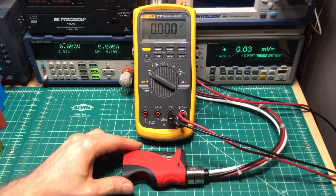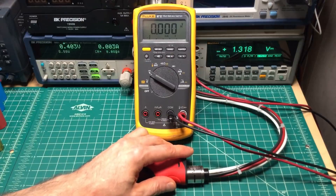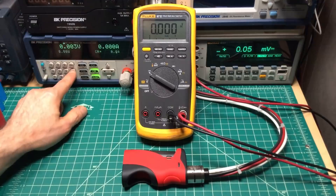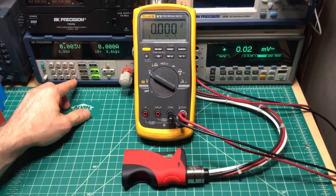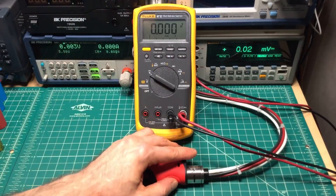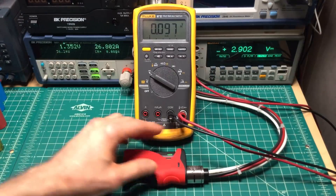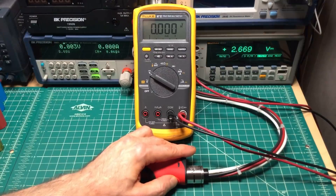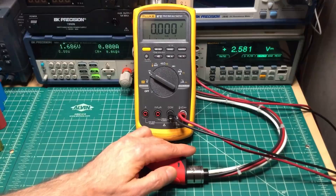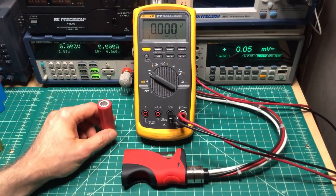For 0.08 and 0.06 ohms, add about 5 watts for cable loss. At 0.08 — the first attempt wasn't seated fully, so redoing it: about 94-95 watts on the first, about 95 watts on the second. At 0.06 ohms — about 102-103 watts on both tests. So with the VTC5A we're probably at about 107 watts total after compensation.